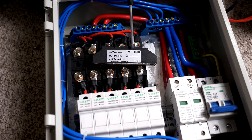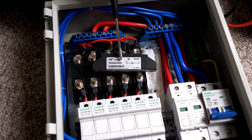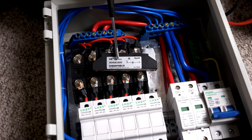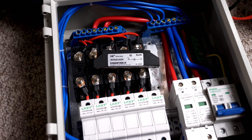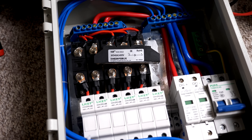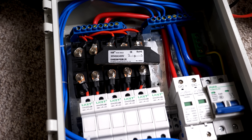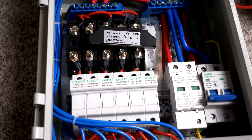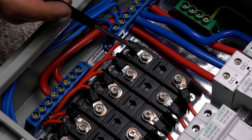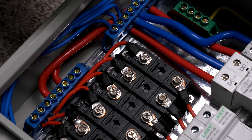The nameplate on the diode shows model MD40A1400V — I'm going to assume that's a 40 amp, 1400 volt diode. A little oversized for this box in my opinion, but it should handle any surges without issues. These diodes are important because they prevent current from flowing back on your solar circuits that might be shaded or have less sun exposure. Coming out of the diodes, we have nice ring terminals where the wires are soldered and heat-shrunken, going into the positive and negative bus bars.